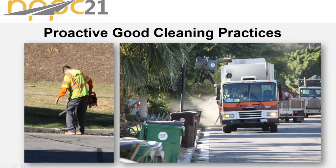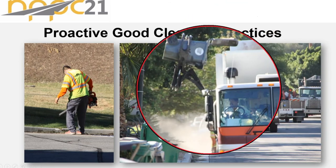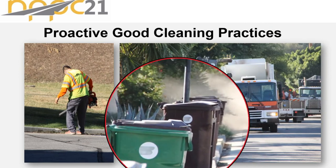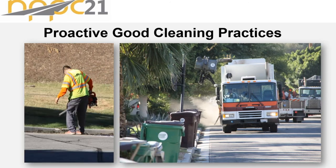It's also a trash truck day. The operator of the traffic control truck sees the trash truck hitting these trees and throwing trash up. He gets out of the truck, gets his blower out, and makes sure he blows all that debris off. That's the proactive mindset everyone needs — a clean surface is a good surface to apply on. This driver understands quality control, has been educated on the process, knows what the right surface needs to be, gets out, and takes care of it before we go to the slurry. No agency wants to find out the street wasn't properly cleaned when it could and should have been.